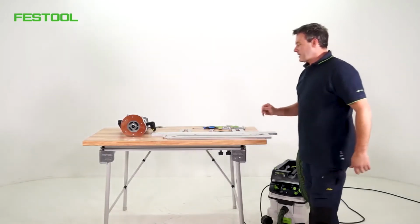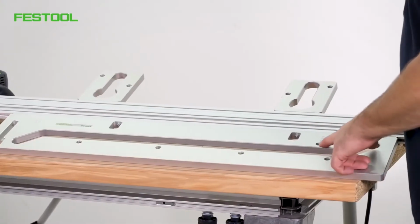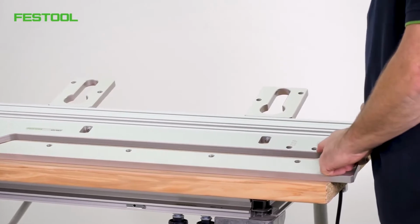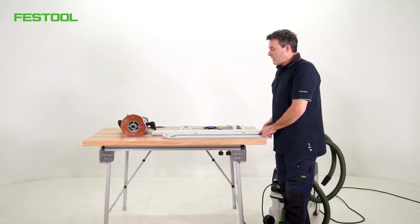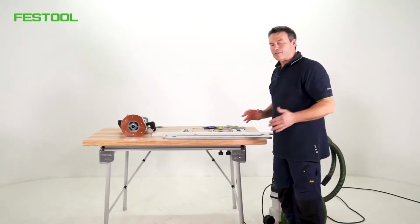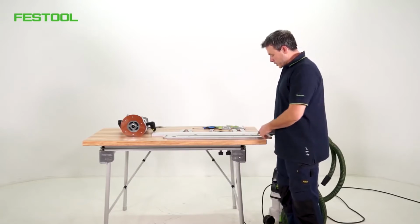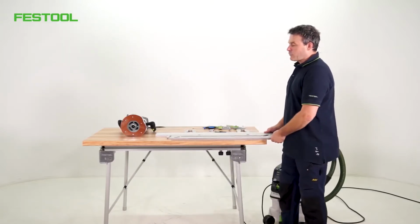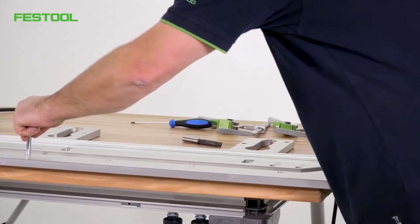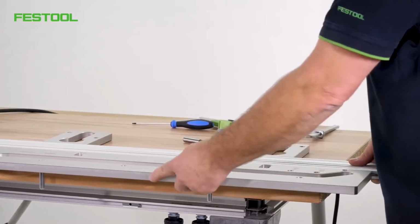There is something else to consider. I can join worktops measuring 600 or 650 or 900 millimeters using this template. I can use the attachment system for these 3 standard worktops with their defined depths. How does it work? Let's take one of the 3 bolts. I'll put the first bolt into the holes. Now I have the front stop point.